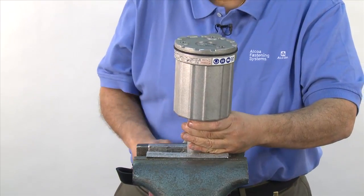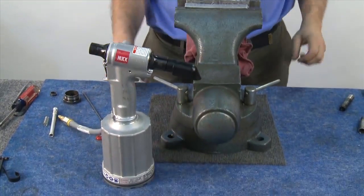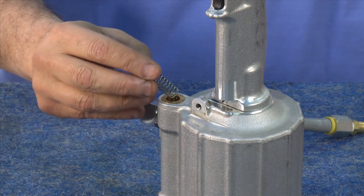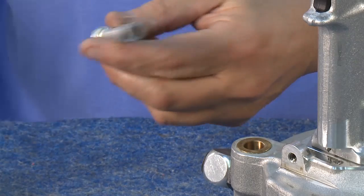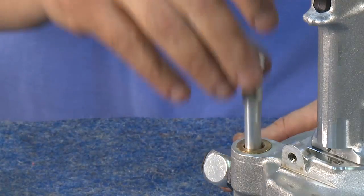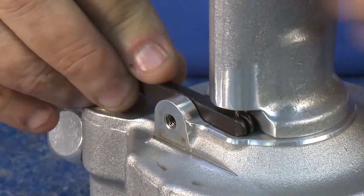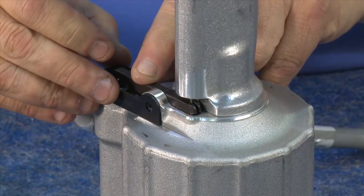Once the cylinder is completely installed, remove the tool from the vise. You're ready for the final step in the reassembly of the 2025: the throttle valve and throttle valve guard. First, drop the spring in the throttle valve hole. Grease the new O-rings of the distributor valve and insert. Manipulate until they go through. Next, insert the cross arm, hooking it through the cable. Insert the guard and then the cross screw and tighten.